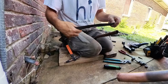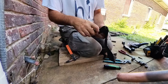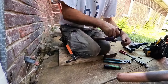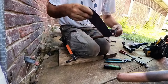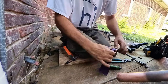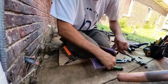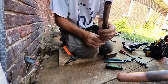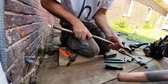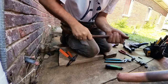The other thing I do is use this cloth — I'm going to call it crocus cloth, but it's just a sandpaper cloth. You've got to have clean tubing for brazing, otherwise it's a nightmare and doesn't fit well. You can bust through and make it happen, but it's sure better to have it nice and clean. I'll hit it with steel wool real quick, just get this tube ready before we expand it.